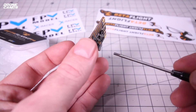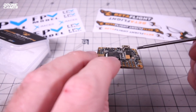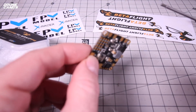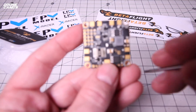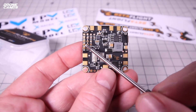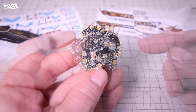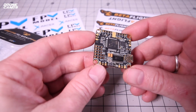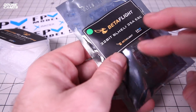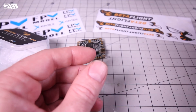There's no labeling on the top for J14 because there wasn't enough room, but if you flip the board over it's all clearly labeled on the bottom. If you want to keep your board clean, run wires from the bottom up through and trim the top pins carefully with snips. Everything is clearly labeled top to bottom, though a magnifying glass helps. If you want the latest and greatest on your 5-inch, the Betaflight F4 paired with the Betaflight branded 32-bit BL-Heli 35-amp ESCs is going to be a pretty nice combo.